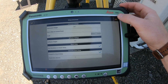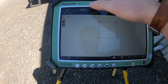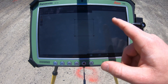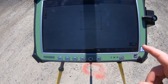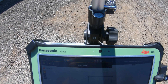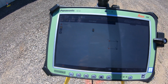Everything looks good there, hit the yellow button. I do have a video on setting up, but I'm just going to go quickly here. So we need to lock our prism next. Now I'm over what I called point one, my prism is locked, and we are in the process of setting up. We're going to hit that one, hit start, and then store. Now I'm moving over to what I called point two. Over point two, leveled up good enough. We're going to click point two and click store. Now the total station will accurately tell you where it's at on site.